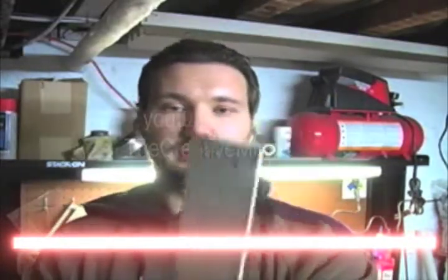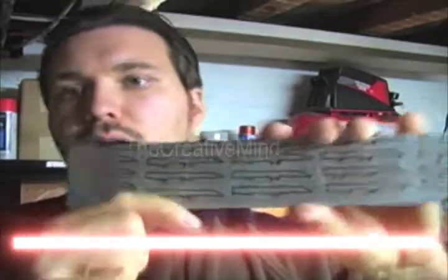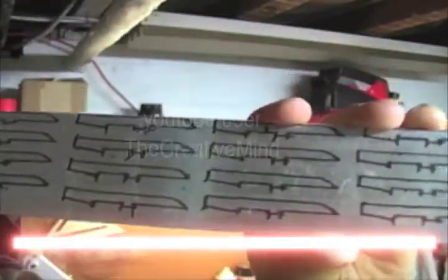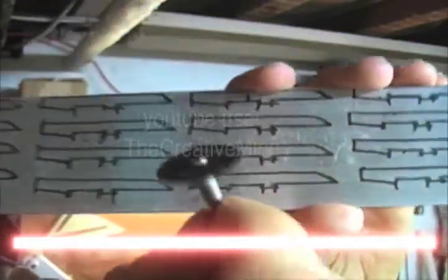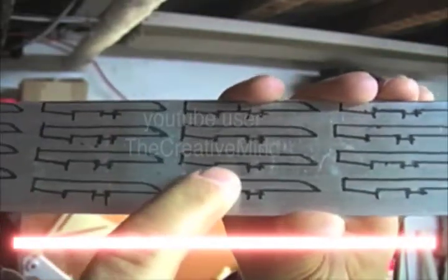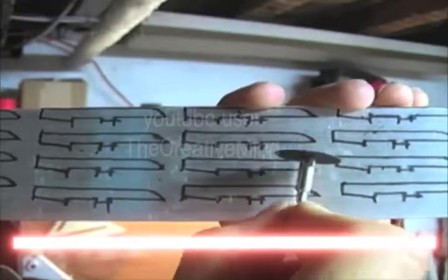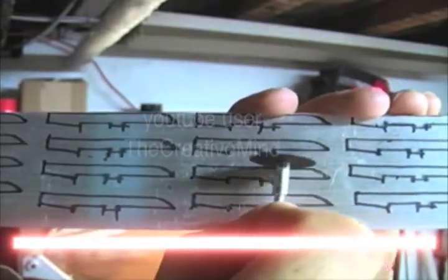Take your cardboard cutout with a black marker and go to your 2x12 by 1/8 inch aluminum sheet, and you're going to trace out 20 of your emitter fins. Now to properly cut these out, take your Dremel tool with a reinforced cutoff wheel. Your actual emitter fin sits right on the inside of your black marker, so you're going to cut across just above the black line.